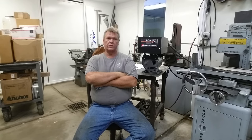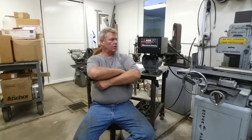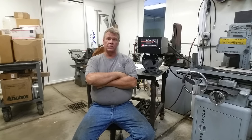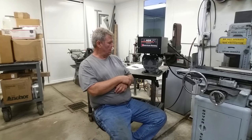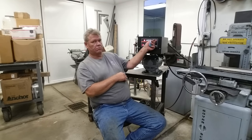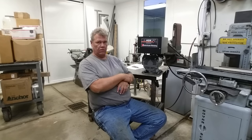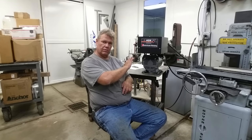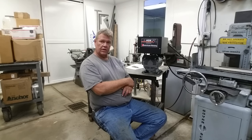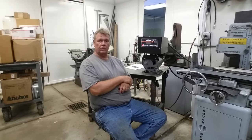That's the end result of the rotary phase converter for point of use — one phase converter, one machine, not feeding an entire shop. A good little unit. Very impressed with the detail — the kit was very complete, everything fit together nicely with no problems. The machine is running. Current draw: just under one amp idling, about four amps total when the machine is running — between the phase converter and the actual machine. Nothing out of the ordinary. If you don't need speed control or any special control requirements, there's absolutely nothing wrong with going with a rotary phase converter.